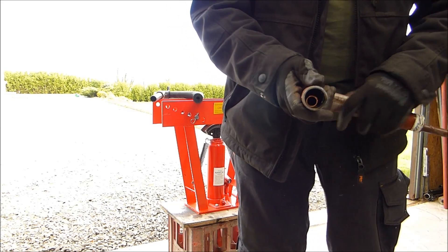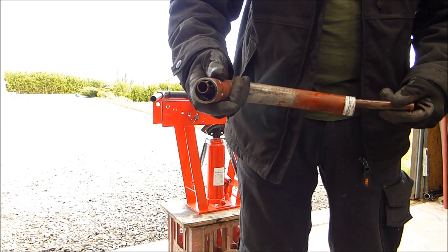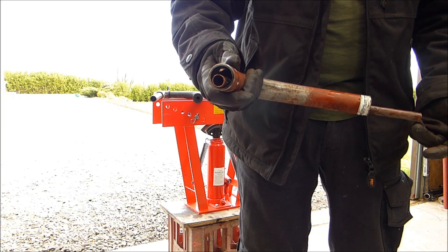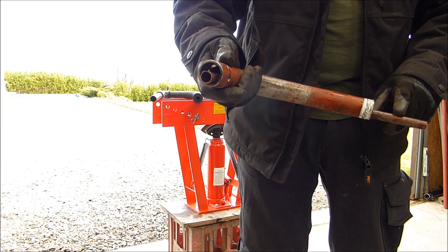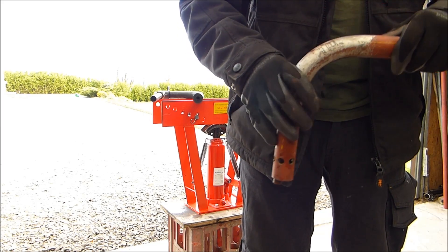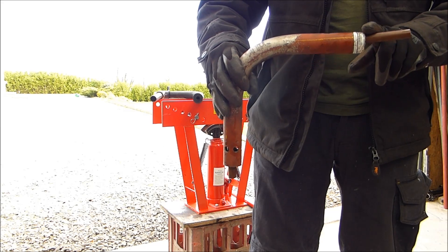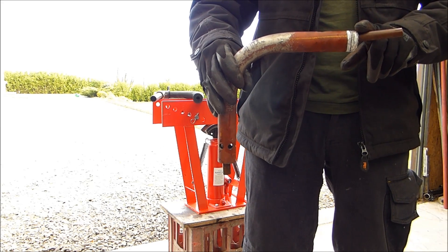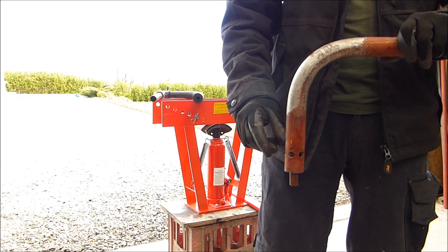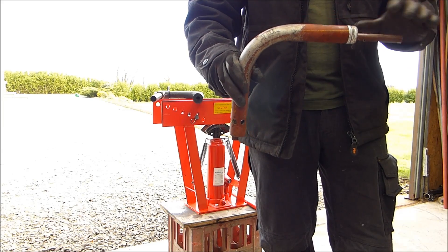What's going to happen next - you can see when I push and pull on the pipe it's one piece. It's a bend and a bend. The idea is that the oil goes down the half-inch copper here and it comes out here. It goes into the stove like this. This end of it is fixed to the wall of the stove. Air comes out here, oil at the bottom. Very, very simple. But you know what? It works. It works beyond what you would imagine. It just works properly, works great. If you keep oil going into it, it returns a massive amount of heat. You're converting oil into heat and it's a great way of doing it for something so simple.